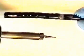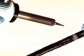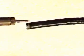Once our epoxy has set up according to manufacturer specifications, we can glue the endoscope bending rubber sheath. Before we glue, we will take our soldering iron hot and we will melt away any loose threads or bending rubber sheath that stick out. Be extremely careful not to melt into the bending rubber or bindings that we have made previously. The solder iron will melt away any strands or debris that sticks out, which would cause the bending rubber glue to have foreign objects sticking out, which cosmetically will spoil the glue job.